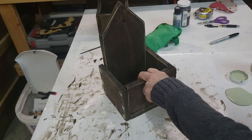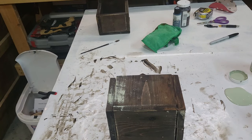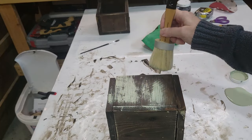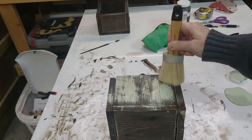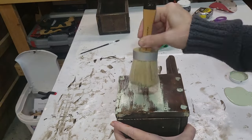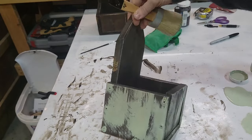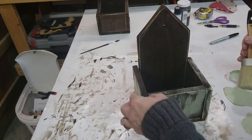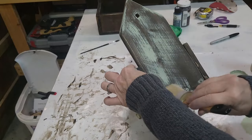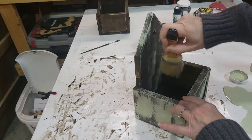I'm going to the side and getting that paint off of the brush — it's just going to be about that much, not much at all. And here we go. I really like that color — I think that'll be perfect. I'm not giving it full coverage because I want a distressed look, like the paint had fallen off over the years. And you can't even tell where the flaws were where I split the wood — how amazing is that? I love it. You'll just keep painting until you're satisfied with the look. You can go as thick or as light as you want — I tend to go lighter because I like everything dark. I do do the inside, the back, and the bottom.